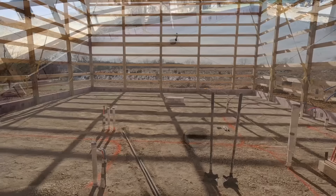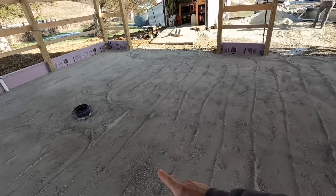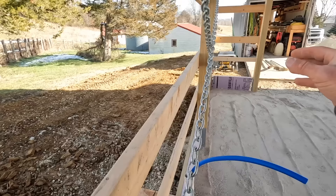In this garage, we just ran two round drains so each bay will be sloped to the drain. They tie together and go out the side of the garage. This will vary by location — whether you're allowed to daylight a drain. Some areas of the country require you to run it into a separate tank where it's filtered and then pumped. But in this case we can daylight it, so our garage has two drains that go to the outside and the pipe will be ran down the hill and daylight.